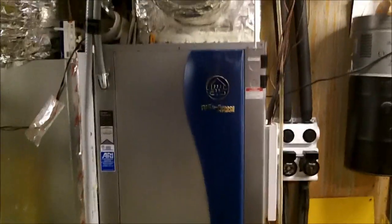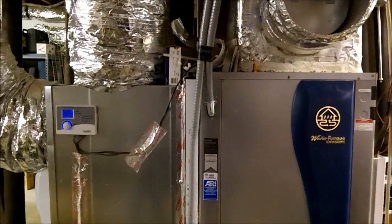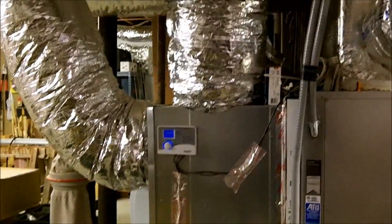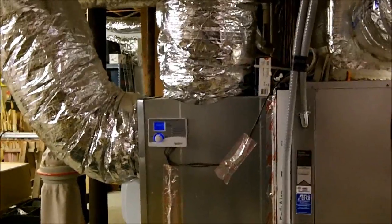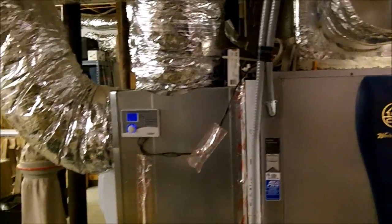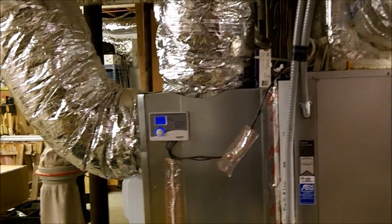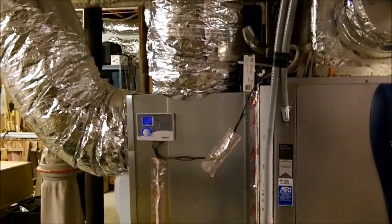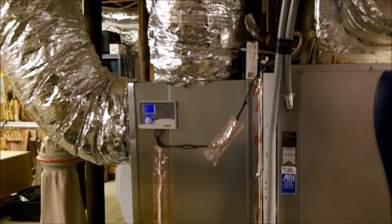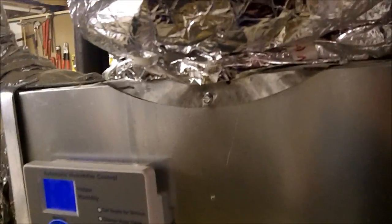Here she is running — stuff's already moved back and she's doing what she's supposed to be doing. I'm going to move that humidistat, put it upstairs, and put a relay in. I'll install a digital EWC humidistat so when it calls, it will bring the fan on, because right now it's in the basement sensing the humidity down there.